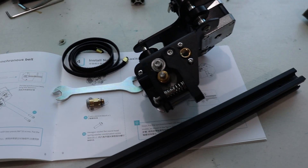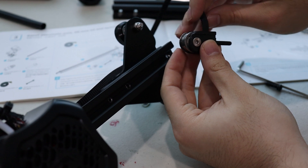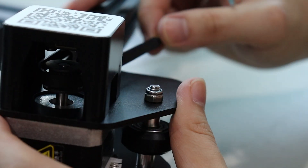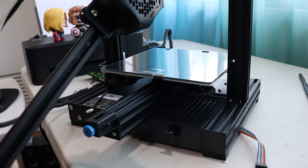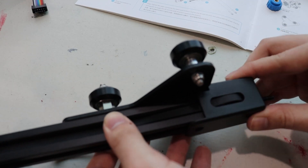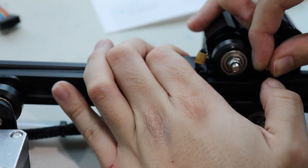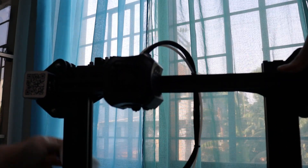The next step is installing the main joint — the pneumatic joint — which is where the actual printer filament comes from. It only goes side to side; the additional movement comes from the bed going back and forth. You want to install the synchronous belt first — very important that you get it nice and flat for a smooth flow. Slide the synchronous belt on top, then assemble the z-axis passive block, then slide the nozzle kit over, and install the x-axis tensioner. Once the nozzle kit assembly is set up, slide it over the two pillars — it slides straight in. Make sure the screwy thing goes straight through the hole where the extruder assembly is. If it slides right down, you're on the right track.